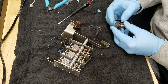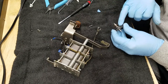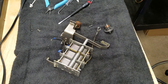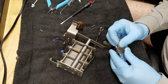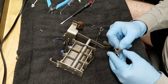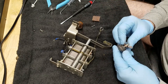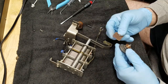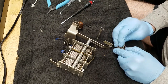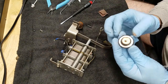I have the wheel cleaned up pretty well. It looks rougher than it is, but I think we can live with that. Now I'm going to take a little piece of coarse sandpaper and smooth out that joint, that seam — you don't have to do much, just sort of smooth it out a bit. Because you don't want to feel a rough spot when you're tuning the radio. But you don't want to remove a lot of material either, because you want this thing to work properly and be round.